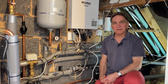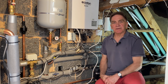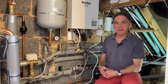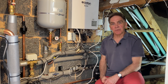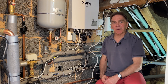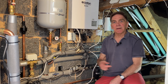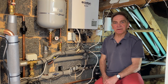You may have heard of the need to replace some pipework when you get a heat pump. That is true. The reason is that the temperature of the water coming out of the pump isn't as high as from a gas boiler. So to warm a room, you need more surface area in your radiators and greater flow of water to them. Your 15mm pipes probably all have to be upgraded to 22mm, and you might need an extra radiator. In total we had two radiators replaced and one extra one fitted, though we've still got some 15mm spurs. As long as the main arterial flows around the house are 22mm, that will be absolutely fine.